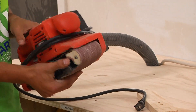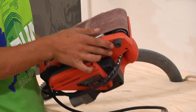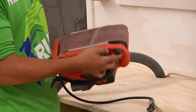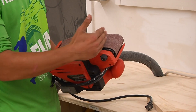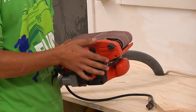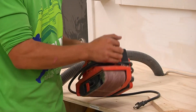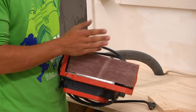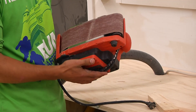What can happen when you put a new belt on is that it rides to one side or the other. The way you fix that is with this adjustment, which tilts the front wheel just a little bit to help it ride right in the middle. Right in the middle is where you want it if you're sanding a surface. If you're getting right up to a corner though, sometimes you want to edge the belt right over to the edge so you can get into a corner, and that's another time when you might use this adjustment.